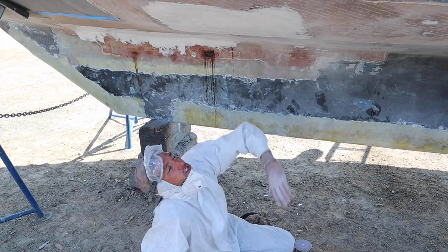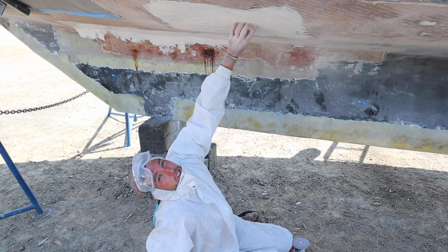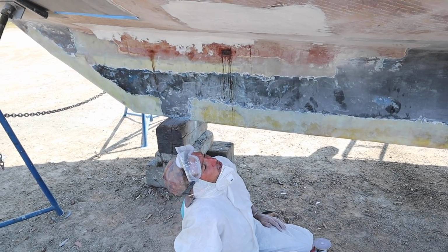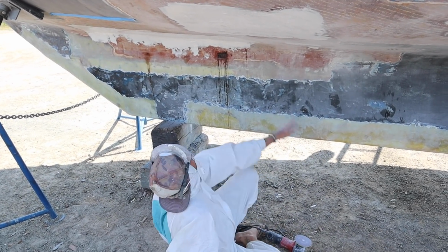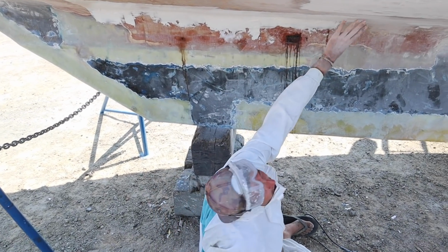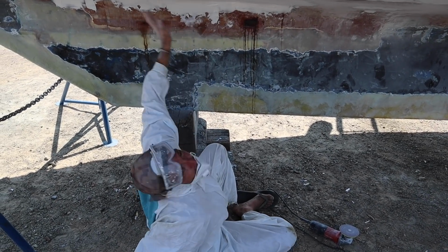And before we glass, I'll scratch it up again with like 40 grit, just give it a hand sand so then it's all scratched and the epoxy's got something to set to. But first we just got to make it flat so it's the same shape as Nandji. So I just got some 120 grit. I just go ham on this patch. This one here, I need to build it up on the inside here, so I might just sand this corner here, and then we can put a big bit of glass there, and then we can glass that afterwards.